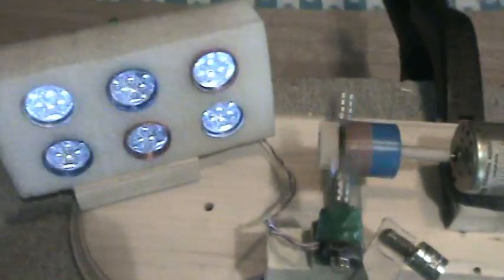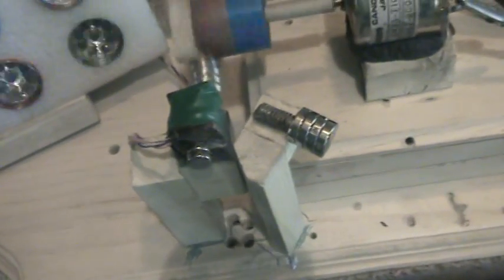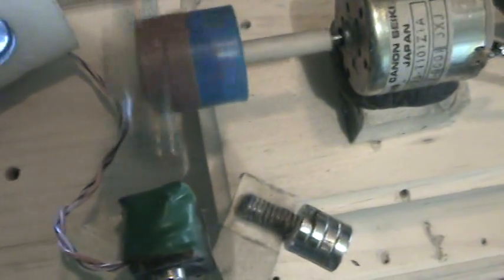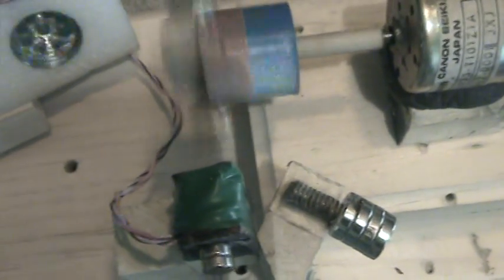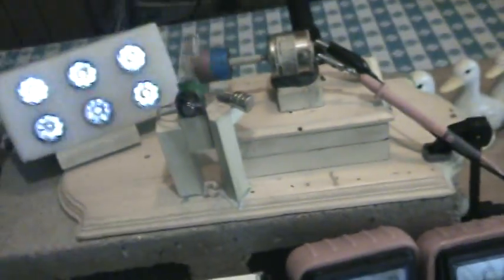Between the coil and the rotating magnets I have about three-eighths of an inch. Between the bolt end and the magnets is about three-quarter inch. I have four little eighth-by-half neos — that's my setup. You'll have to adjust that and work with it, of course everything's different.